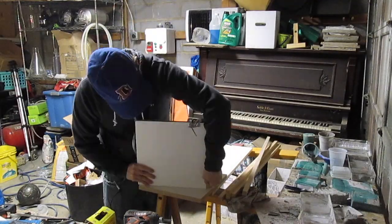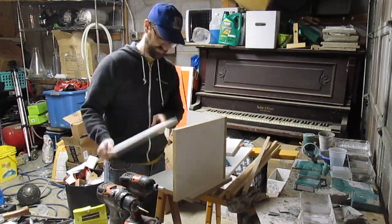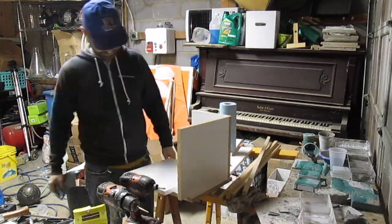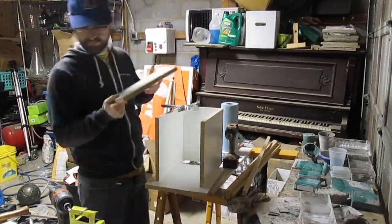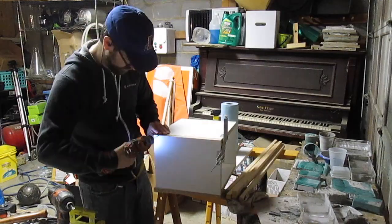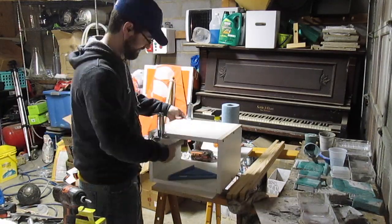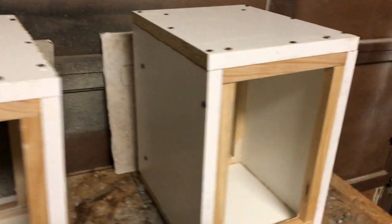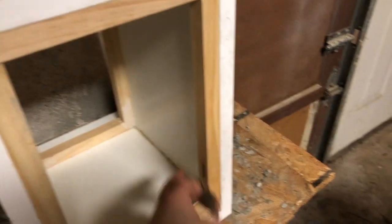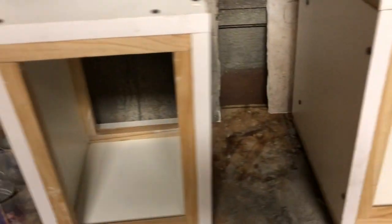The next step was to build the mold. It's just a box made out of three-quarter inch melamine particle board — you make it like any kind of box except it's only got four sides. Here you can see I'm assembling the sides using a corner jig to try to keep everything square. It worked pretty well but could have been a little better. I'm just screwing the box together so it will be easy to assemble and disassemble and checking for square. The molds also use some oak dowels that I covered with paste wax, and I've sealed up all the gaps. I've got two of them so I can do both, and I'm also going to be making some little lamp things.